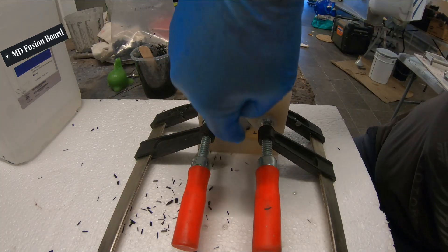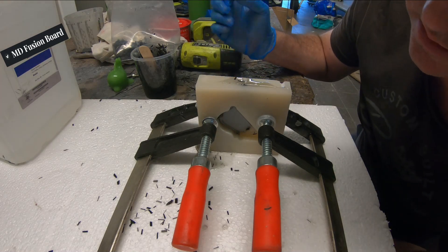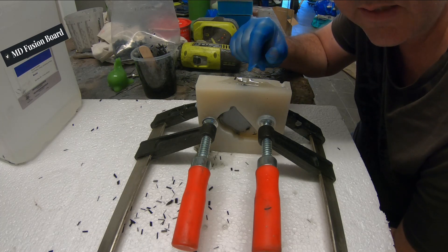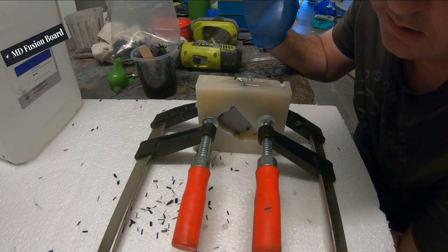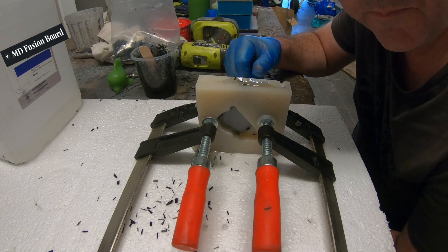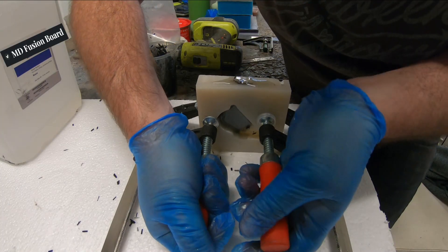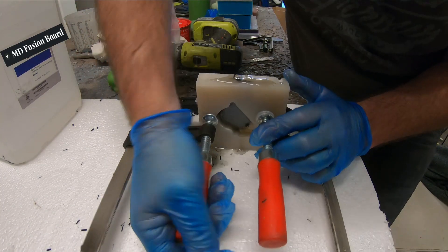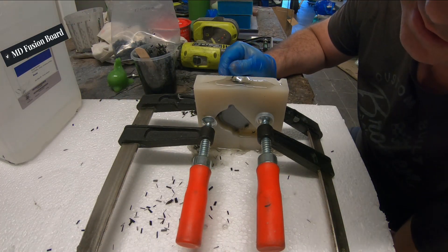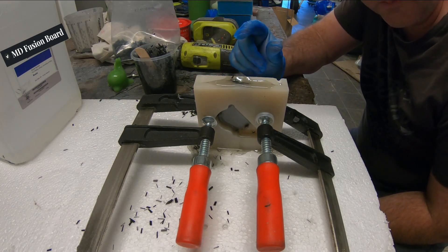You can see I always leave a little bit down the bottom on the male side of the mold just to let the resin out, because the least amount of resin gives you the finest, lightest part possible. You want to squeeze out all that resin — you're left with a carbon fiber plate the shape you want. We've put mold release on this, no gaps around the side of the mold. We left a 4mm hollow in the center of the female-male mold so it'll leave you a 4mm carbon part.